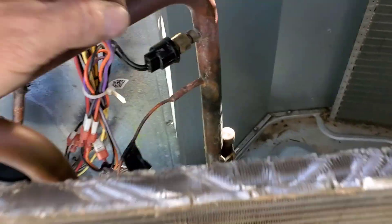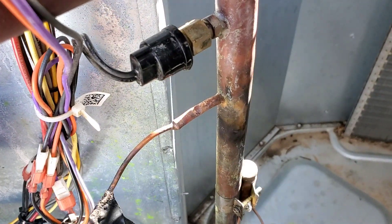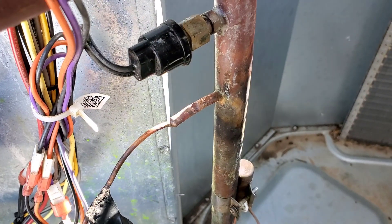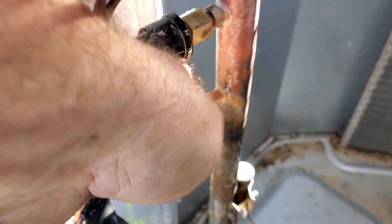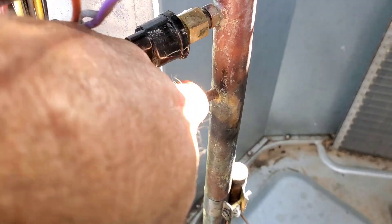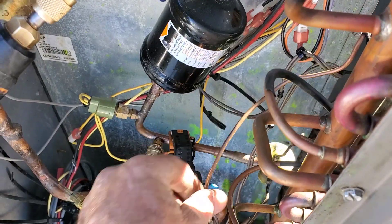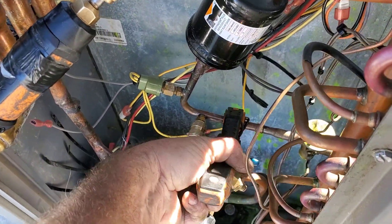I had flare nuts and everything on my truck this afternoon, so I went ahead and stuck the equalizer tube back in there and brazed it up. Tried to get this rounded out — it seems pretty stiff. It's not totally round, but I'm sure it's open enough that it's got flow. We'll find out when I run this sucker next time here.